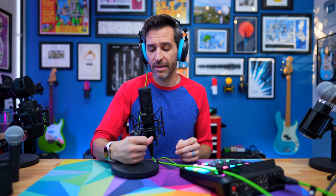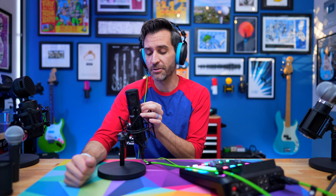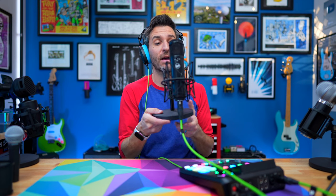The microphone has some switches on the side because it does a few interesting things. It lets you switch pickup patterns. Right now I'm in cardioid, the standard pickup pattern, which means as I turn the microphone away you won't hear me as well. There's a little switch on the front to change the pickup pattern — switching to figure eight means pickup happens in front and behind the microphone. As I turn the microphone, my voice should start to disappear from the side.